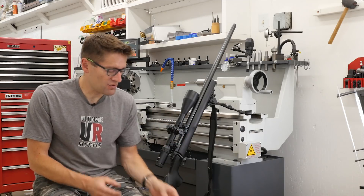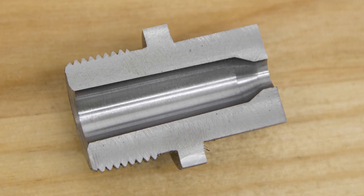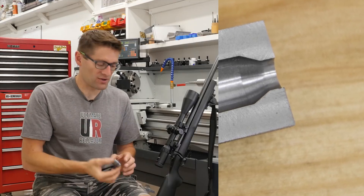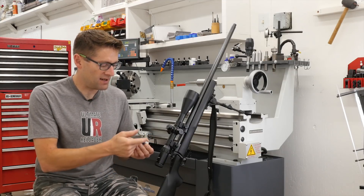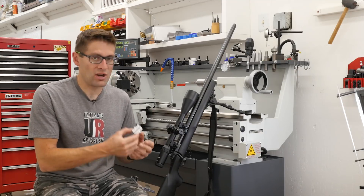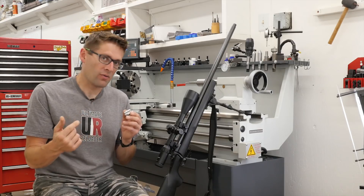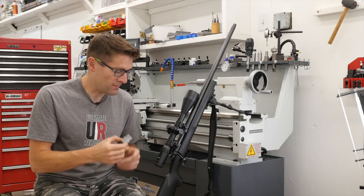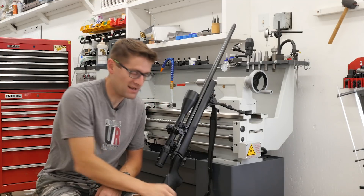I went through a complete dress rehearsal on a two-inch cut-down section of the barrel — a little extra bit on the chamber side — and that was invaluable. I threaded the tenon, cut the shoulder, and did the chambering using a Manson reamer. A finished reamer went all the way in. That's one of the ways you can do it. And this showed me: yes, this is going to work, you're ready.